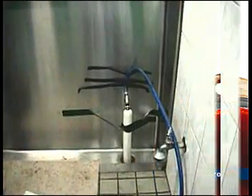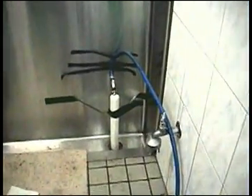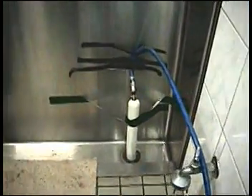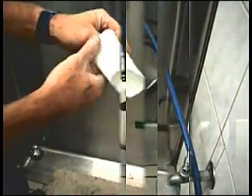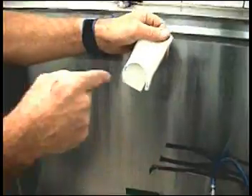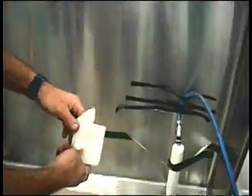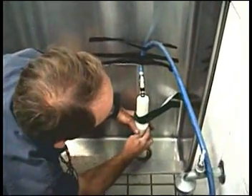What you are about to see is the rehabilitation of a 2 inch urinal drain using a Nuflo spot repair. This piece of felt is the base for the structural repair. It is impregnated with epoxy, wrapped around a bladder which is then inflated inside of the drain.